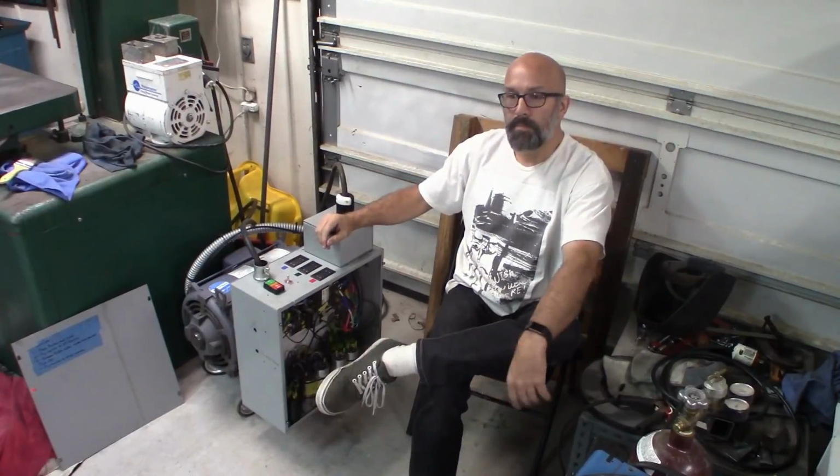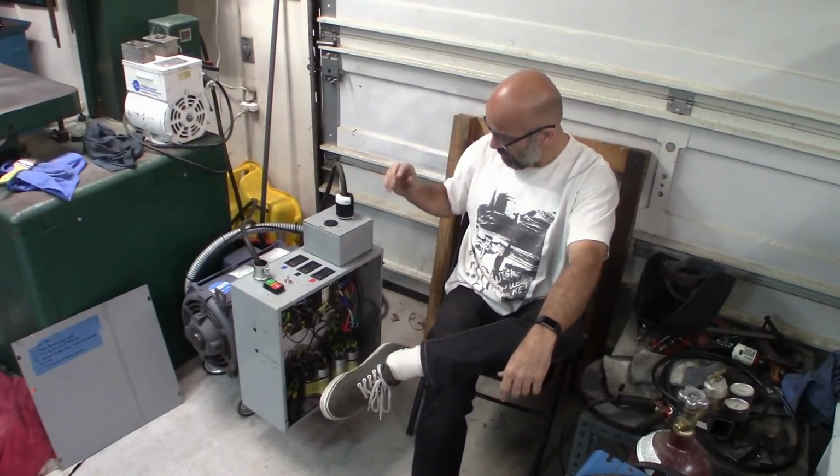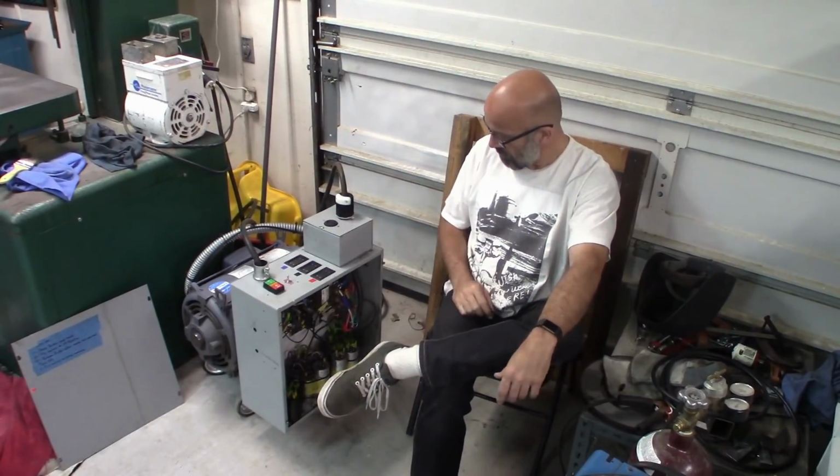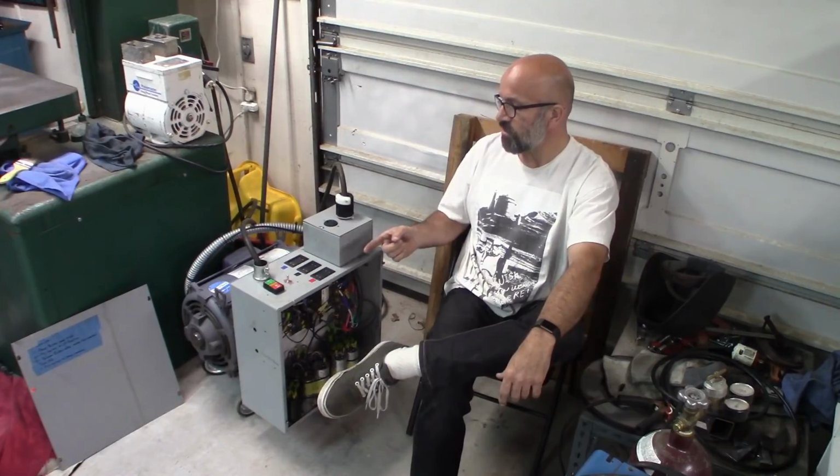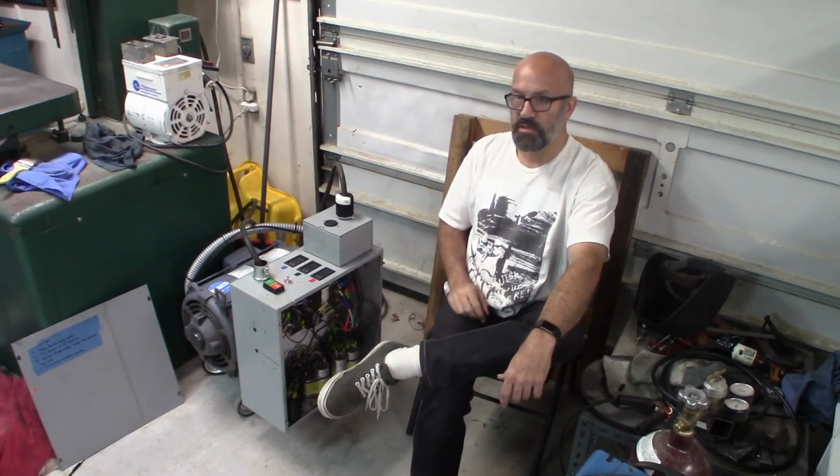This has been a pretty long build, and it's been a little bit touch and go at a few places. Still a little bit worried right now. Sometimes it has a hard time starting, so I can try to engage it, and it looks like the motor starts to spin the wrong way, and then it kind of just vibrates back and forth. If I shut it off fast enough and try again, it'll usually start right up. Otherwise it blows the circuit to the shop and I lose all power.